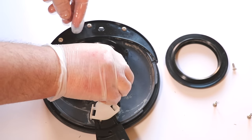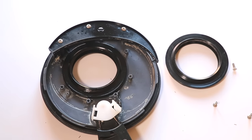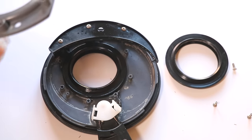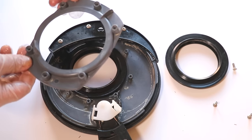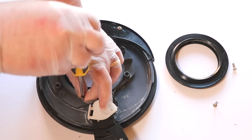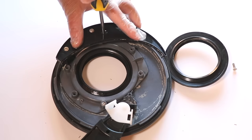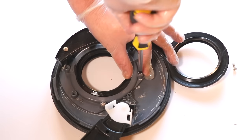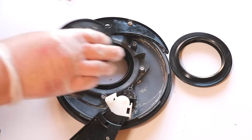Refitting is easy. Place the seal with the bevelled edge face down and replace the cover back onto the seal. The cover will only fit one way as there is a locating pin on one side. Screw the cover from one corner to another — this will ensure that the seal cover goes back on flat. Also don't over-tighten the screws; you risk damaging the cassette lid, so just make sure they're finger tight.